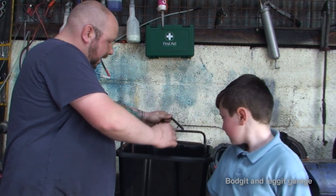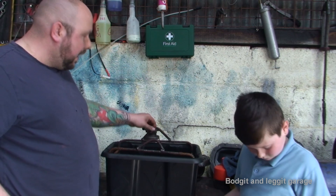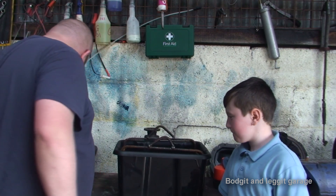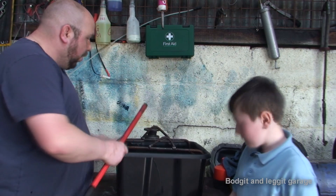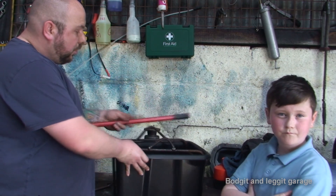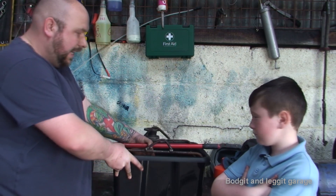This just slots into the tub — it's a bit tight, but that's okay. Now we have our frame in our bucket. The handles are where I'm going to attach one of my cables. The tool you're trying to remove rust from needs to be suspended in the middle of the tank. You cannot put something metal across the metal frame, as that will cause big problems. You can use something metal provided it's not touching the inner frame, or you can use wood. I'm just going to use wood, with the tool suspended on a piece of wire.